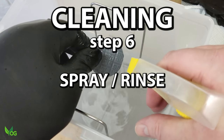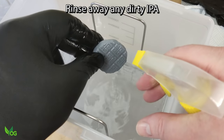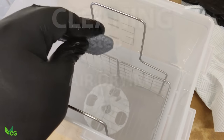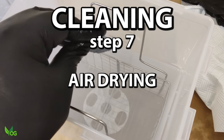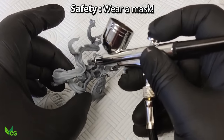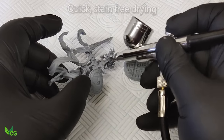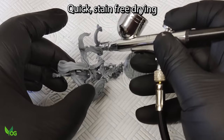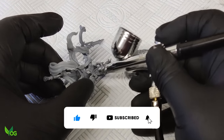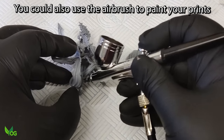An optional further step at this point is to spray with completely clean, brand new unused IPA to rinse everything away, leaving you with a fully cleaned print. You can use an ordinary hair dryer on a cool setting to dry off your prints, or you can just let them drip dry. Personally, I've found this airbrush tool excellent for this job — it gets in all the nooks and crannies, particularly with hollow prints, driving out all the excess and drying things off much more quickly. This should leave you with a spotlessly clean print, made possible with mostly recycled IPA.